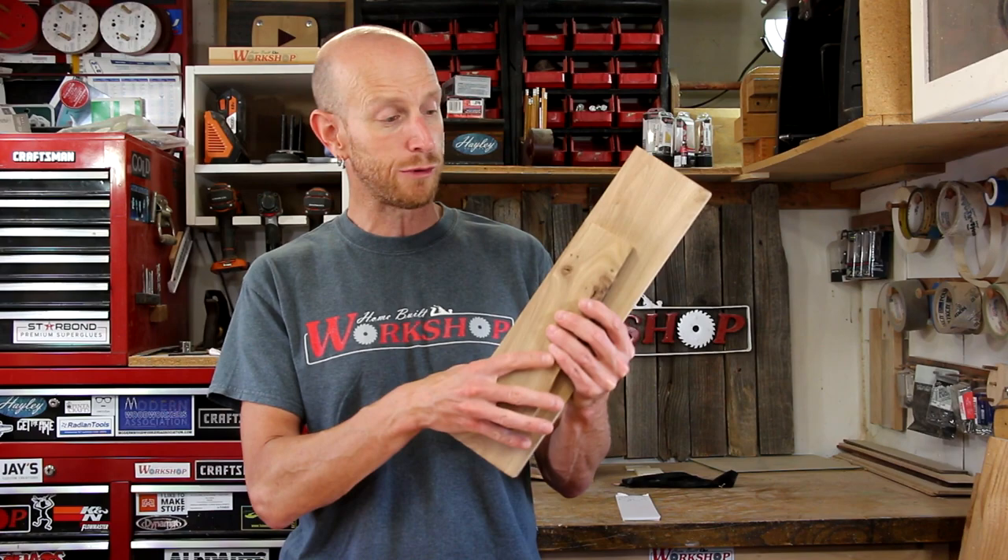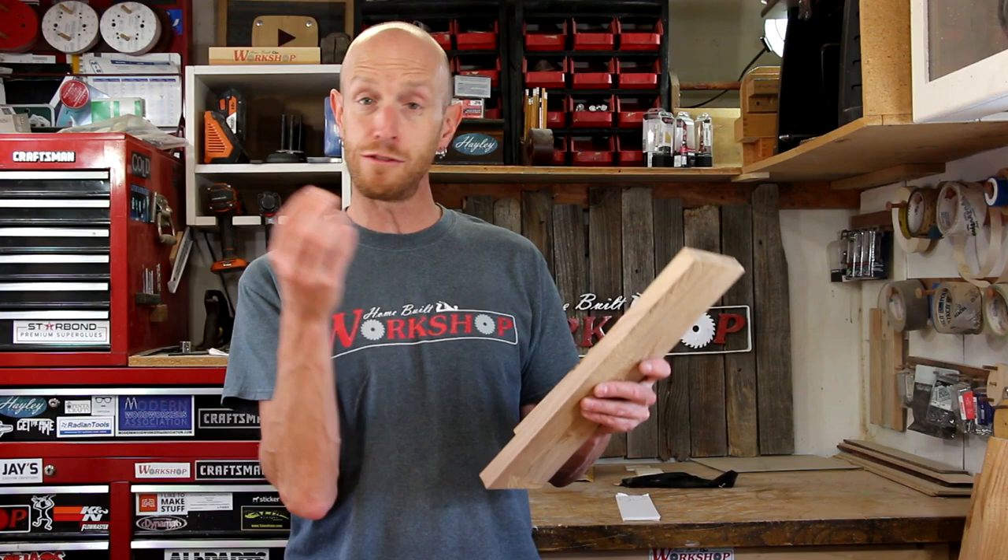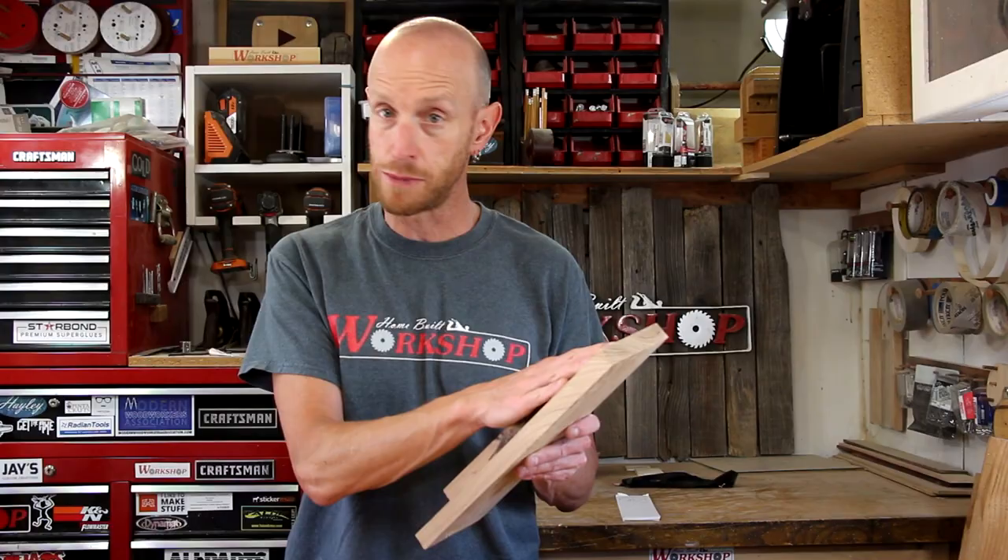Since I'm building a very small frame, I don't need a lot of material. Looking through my pile of offcuts, I've got these few small pieces of elm — I think these are going to work perfect. These are leftovers from the elm table that I made recently. I originally wanted to use barn wood, but since we're cutting these into thin finger joints, I didn't want to risk the softer barn wood breaking, so using a hardwood is probably a better idea.